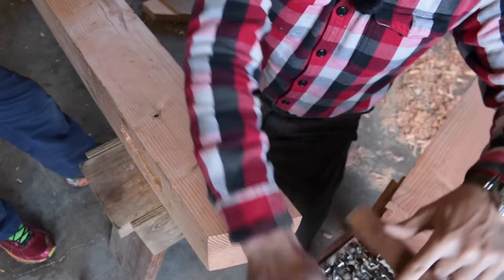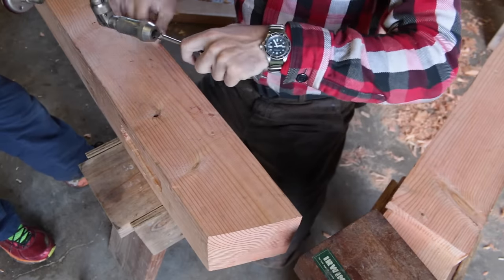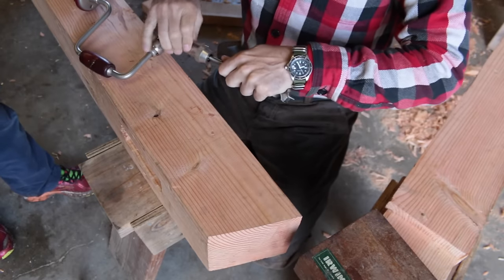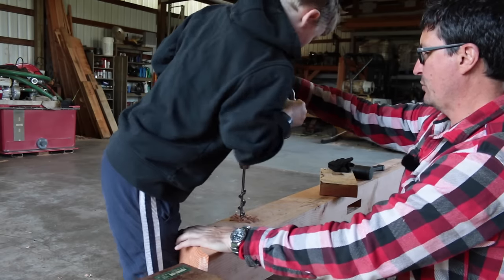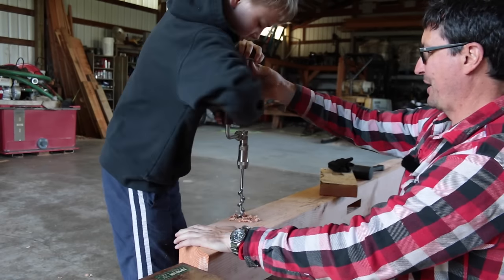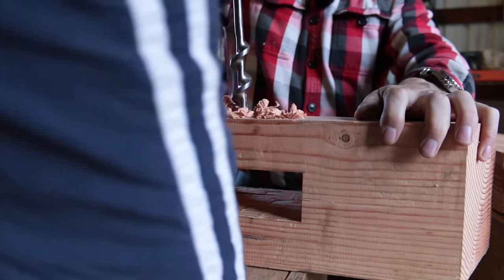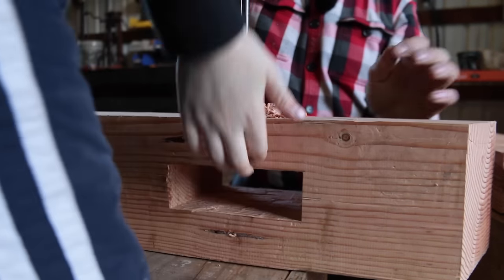So I've got Jack today — we are having homeschool subject woodworking today. One thing that's kind of tricky with the bit and brace and a big hole like this is to drill straight, and that's what we're going to work on. We're going to drill a one-inch hole — we'll take turns, I'll do one and then you do one. It's a lot more fun than math. You need immense power to get it around — momentum definitely helps, but it also comes at the expense of accuracy. Go ahead and check your bit to see if you're poking through at all.